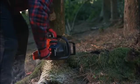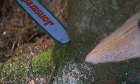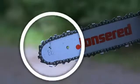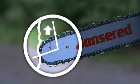The greatest risk when working with the chainsaw is injury due to kickback. Kickback occurs if you apply the saw in what is known as the kickback risk sector on the top of the guide bar nose. The guide bar will then climb upwards and the whole saw will be thrown backwards by the force of the rotating chain.